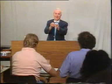Now, we already know that when we do this, the material is going to strain harden. But what I'm interested in is how many cycles it will take to fracture the material if I bend it back and forth at exactly the same spot. So I want you to continue to do that and see if you can remember the number of cycles that it took you to do it while I begin to talk to you about something else.